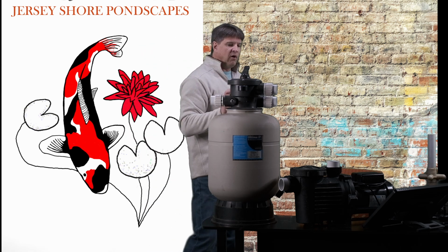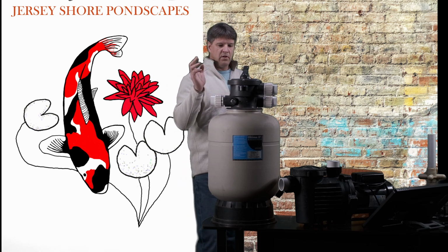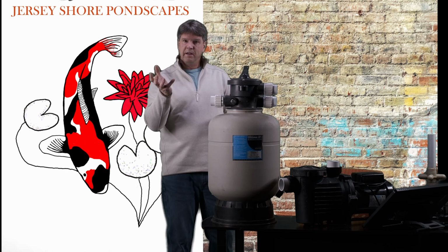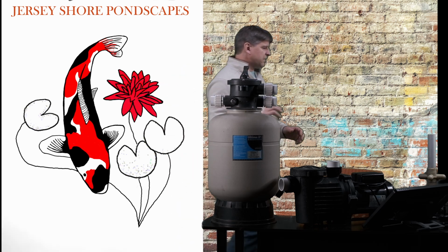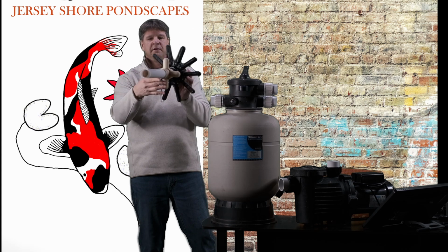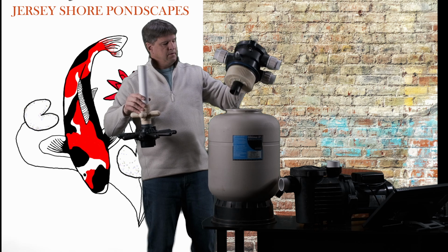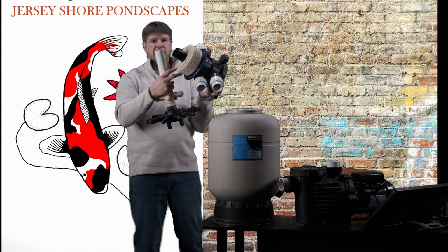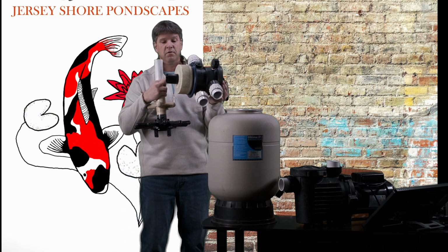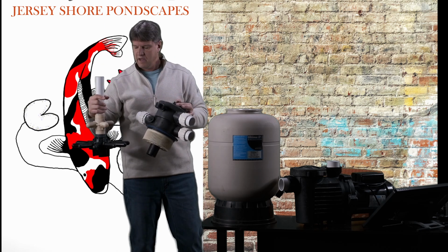So now let's talk a little bit about what's inside, all right? I showed you all those little beads, okay? I took this out already. This is basically what you will find inside these filters. Now, when we lift this up, there's a strainer basket here, okay? This is really important that this stays on this head, because if not, then all the beads can come out and be pumped back to your pond, okay?